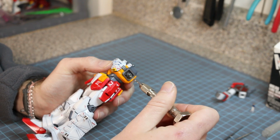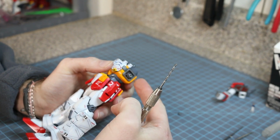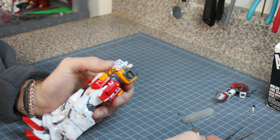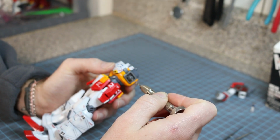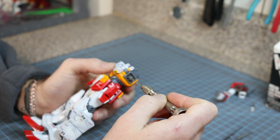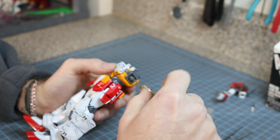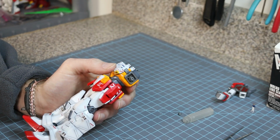Now, when it comes to the body here, I know that behind this piece here, you can't drill too far into it, because if you push on through, if you put that metal rod in, it will limit your arm from being able to swing out on that pivot point that it has. So again, I might even take one of the smaller drill bits that I have, and I might do a starter pilot hole just to get directly in the center, and also because this hole doesn't exist anyways, and there was like a piece of crossbar plastic. Basically, it was like a plus sign. There was going to be all the plastic in the middle. So I think I started a pilot hole just to make sure that I was going in straight and at a 90-degree angle and completely straight down. And then I came back to this tool and whittled in just before I poked through that part, and I stopped and then backed it out. So that's how I would do that.